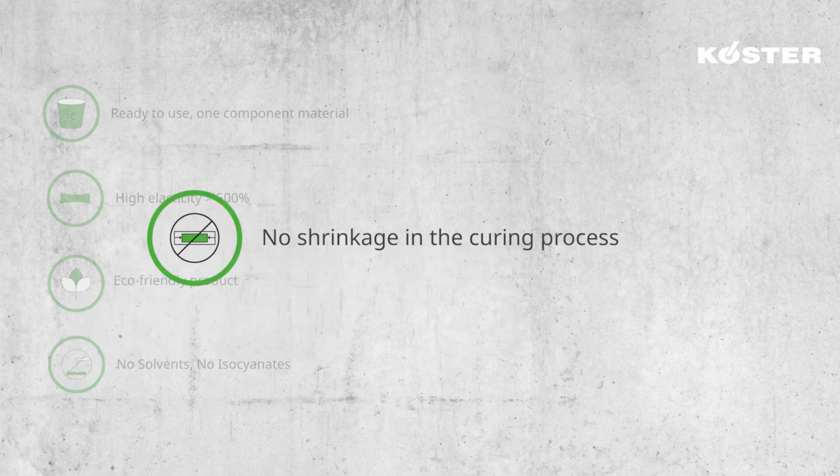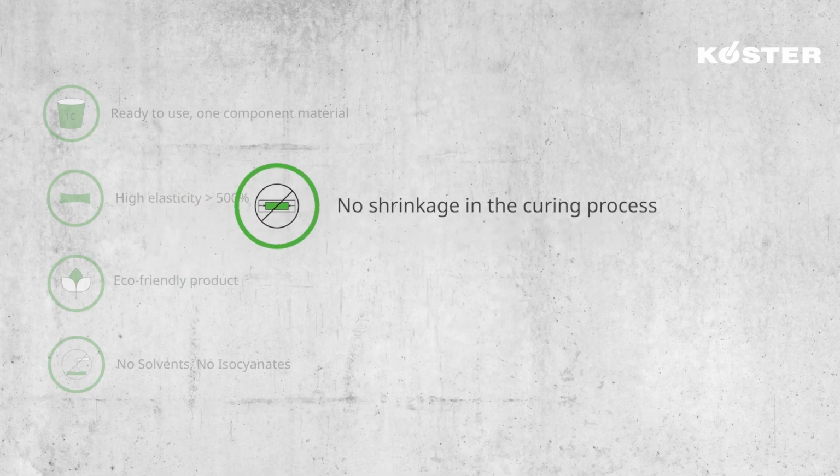No shrinkage in the curing process. As it is free of solvents, there is no solvent escape during curing that leads to shrinkage and consequently crack formations. This is a common problem of solvent-based polyurethane coatings. Because it's solvent-free, it can be applied in higher thicknesses than solvent-based coats.